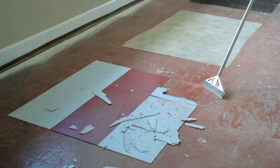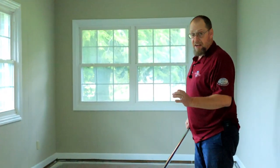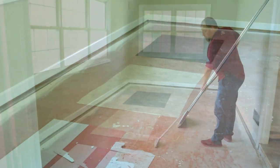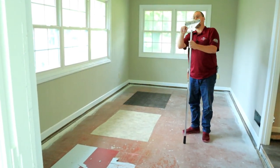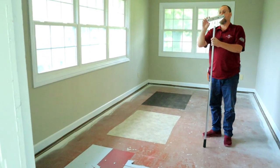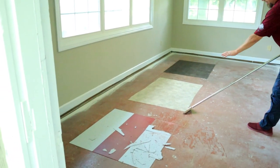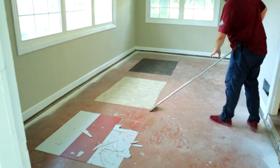Now I'm going to take this scraper and try some sheet goods. This might do fairly well because it is a thinner, softer product — not as hard or solid as the VCT. It's angled right here, though I already broke the blade doing that tile, so definitely not a good choice for VCT demo. Anyway, we're going to take it at an angle into the sheet vinyl and slice it right up off the floor.